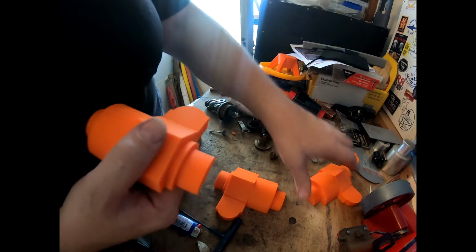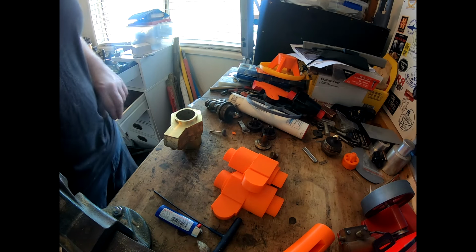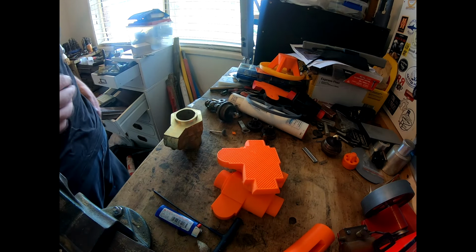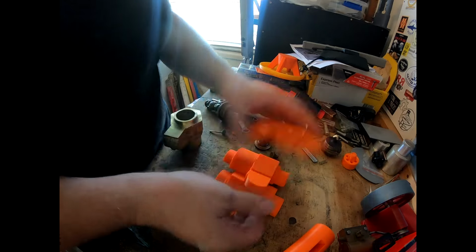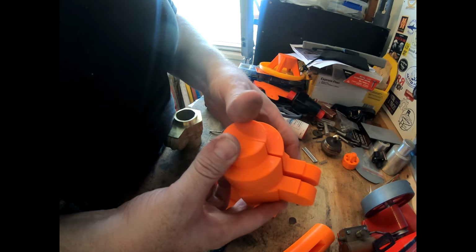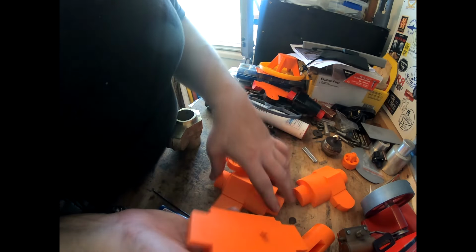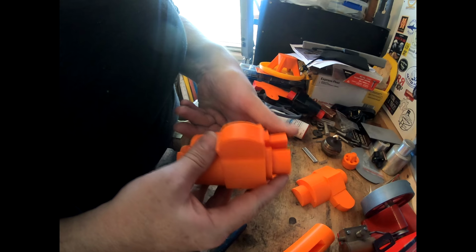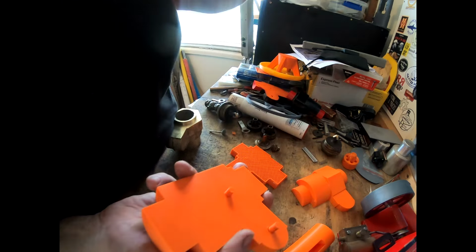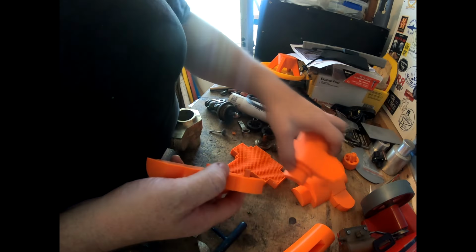I've got, honestly, a bit of a stack of these that didn't turn out. There's another one somewhere as well, I think. One of these I didn't put the shrinkage on, which to give you some idea on the shrinkage amount is... That one has got the shrinkage on, but it's wrong. This one's right, but it hasn't got shrinkage, so it's that much. See, if we have a look, it's 1.6% smaller. So that doesn't work.